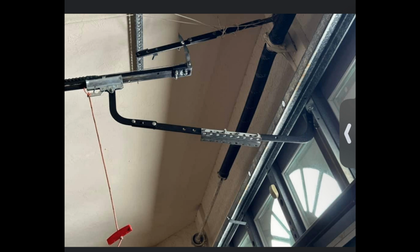And this guy really had to extend his arm. You can see at one point he must have had a Genie, because he's got that crazy arm made out of Genie arms. And he's got some angle holding the two pieces of the arm together. And then you can see for the header bracket, we have the Chamberlain arm installed up there. And then we got one skinny piece of angle going down to what looks like just one side of the header bracket to hold that on.